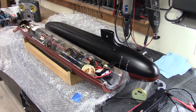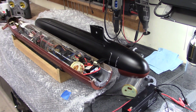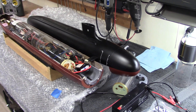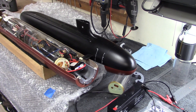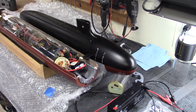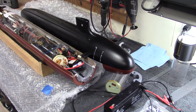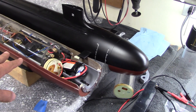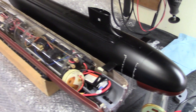This is what is typically termed as a Thor Seawolf kit in 1:96 scale — an absolutely gorgeous kit. This was a commissioned build for me a few years ago, about three years ago. It has a three-and-a-half inch OTW dive module and a pump-based ballast system.